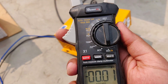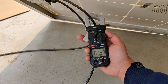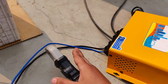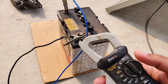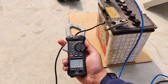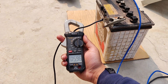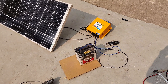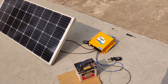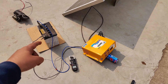Let's do the same measurement with a clamp meter. Measuring the current from the solar panel, it is drawing around 4.75 amperes, fluctuating up to about 4.85 max. Now measuring the battery wires — 6 amperes going to the battery while taking in only about 4-point-something amps from the panel. It is actually boosting the power to almost 6 amperes. You cannot achieve this type of output from a PWM controller — only MPPT can do this because of the boosting coil. Remember: when connecting the MPPT controller, always connect the battery first, then the solar panel.